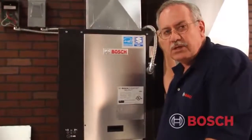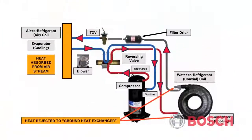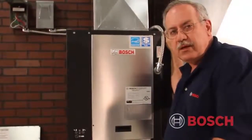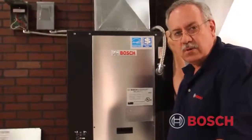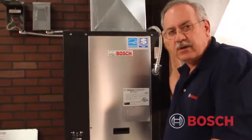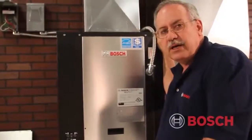We want to check the unit in full load. This particular unit has an Ultratech Copeland compressor, which is capable of 67% first stage in heating or cooling and 100% in full stage — Y1 and Y2. We'll always want to check the water side diagnostics in full load, meaning either jumping it out or calling for Y2 mode. We'll set up our testing equipment and energize it in the cooling cycle.